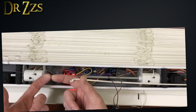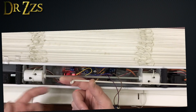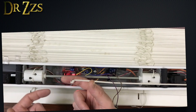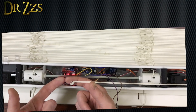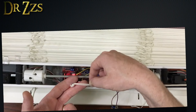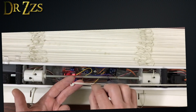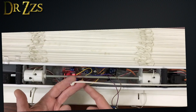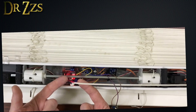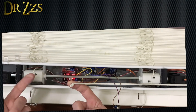In fact, I think by introducing this thin wire I made a new problem. Raising the blinds is actually slower than it was, for two reasons. One, because the cord is so much smaller, this cord would wrap up and eventually wrap on top of itself. The radius of the spool got bigger as this cable wrapped around it, and a bigger spool means faster lifting. So by putting this fishing line on here, I actually slowed it down. That was not intended.